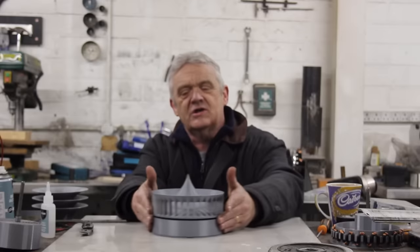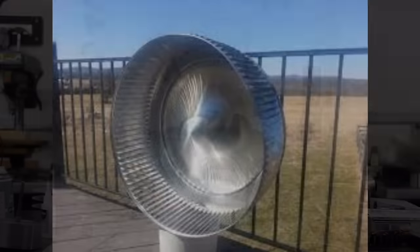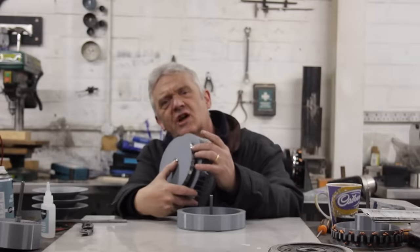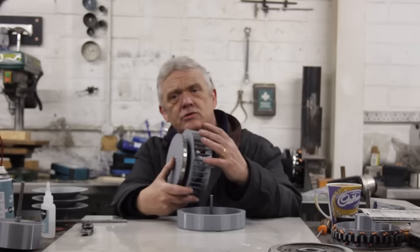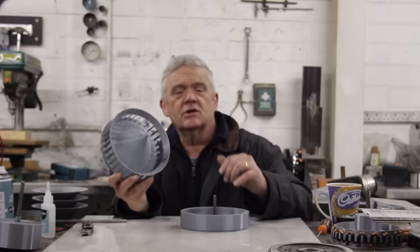We started this project with a Waters turbine. There's lots of information about the performance of Waters turbines — they're very interesting things. We started with the rotor attached to the turbine because we're interested in the speed of the rim as a possibility for generation. Connected to the water turbine is a generator containing a serpentine coil.